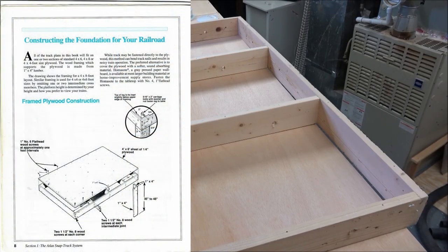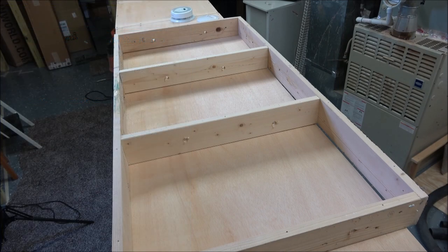Here is some old bench work from my previous layout — a two-foot by four-foot module. You want to put a plywood top like you see here on this table, preferably half an inch thick. Some people want to save weight or costs and do a quarter inch thick, but there are susceptibilities with that. My suggestion and preference is to do a half-inch sheet of plywood on top. For the skeleton or structure of the module, you're going to want some nice pine — they have it called select pine at certain retailers.